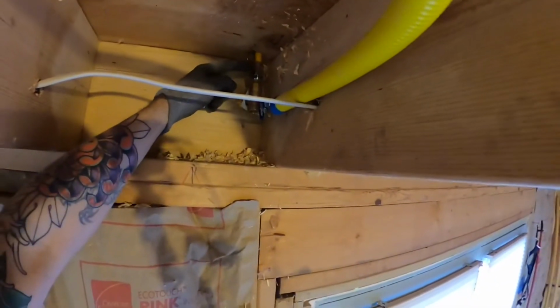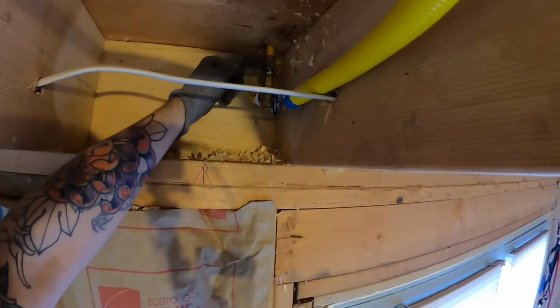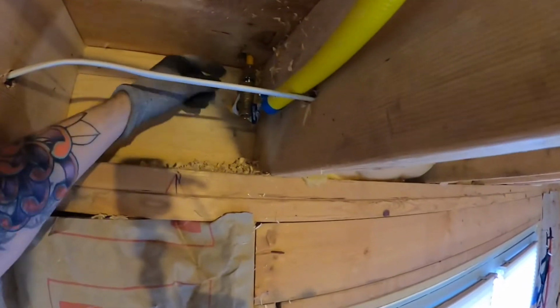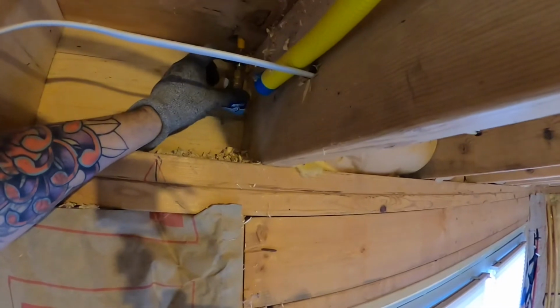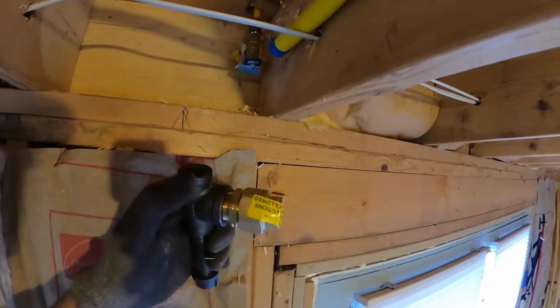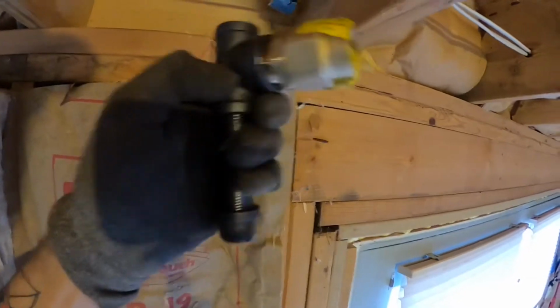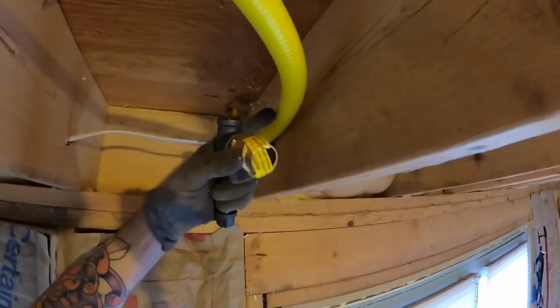So this is a compression fitting on top. This thing's kind of flared, and that goes on the top of this, which is a compression fitting. You don't need tape or dope or pipe tape or anything like that. And then down here, where the bottom of this threads into the riser, that's when you need to use the paste or tape. And this needs to be taped, the bottom needs to be taped. This is that odd compression fitting that they say is a pain in the butt with this stuff.